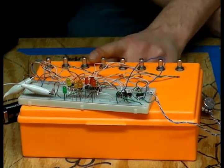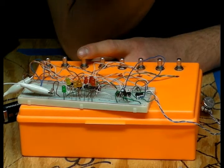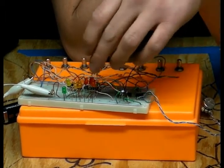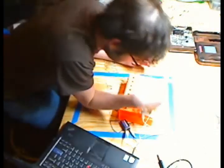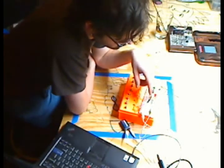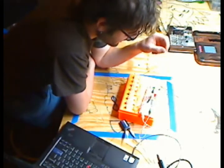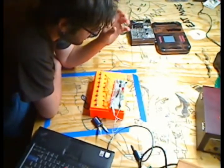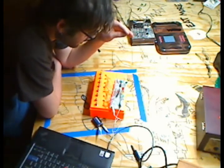So basically, you have the control voltage changing the step on the 4017. It's lighting one of these LEDs on every step. There we go. And then the voltage triggers the NPN, which makes the connection between the two legs. So you're in essence making a switch. Every time it gets voltage, it's going to allow the two other legs of the transistor to make a connection.